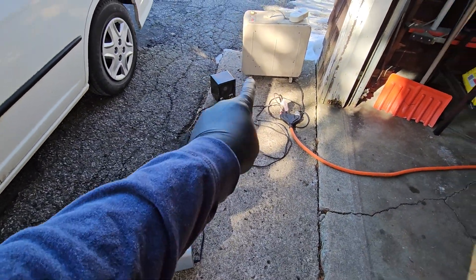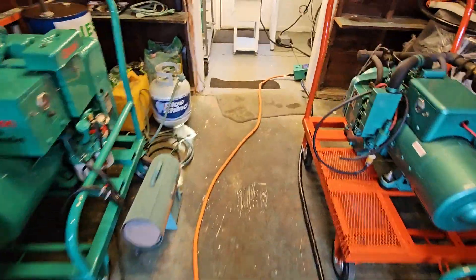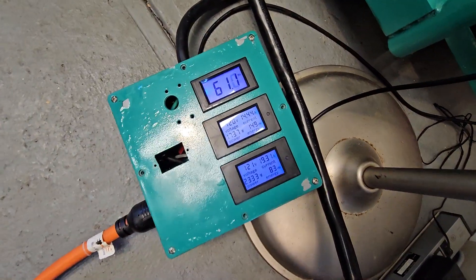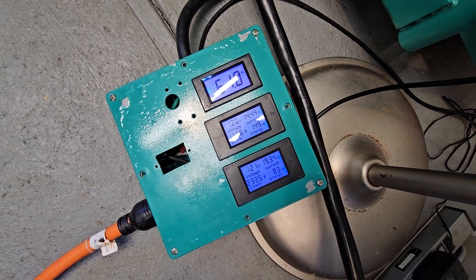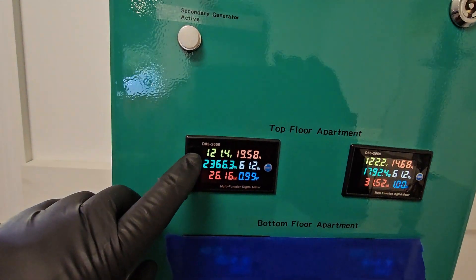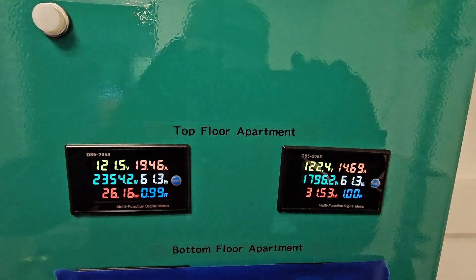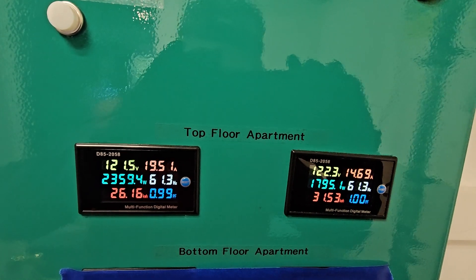I got this heater right here, that, and that — for a total of about 4,000 watts. That's monitoring my little load bank outside. Let's see if it coincides with the box on the wall. We've got our voltage, our wattage, and our amperage — one for each leg. Add everything together as far as the wattage and that will tell you. Looks like it's good.